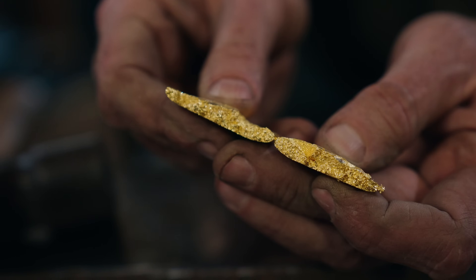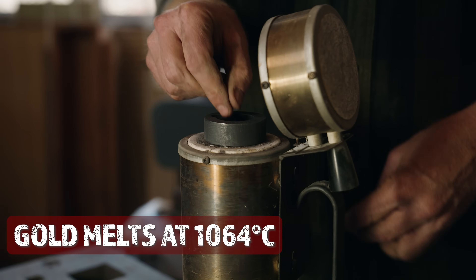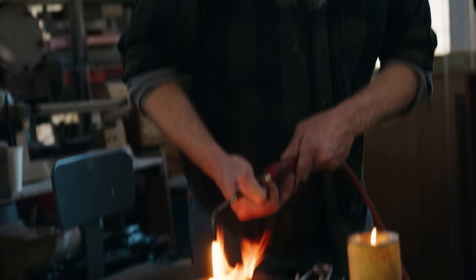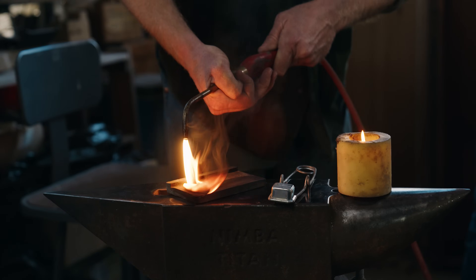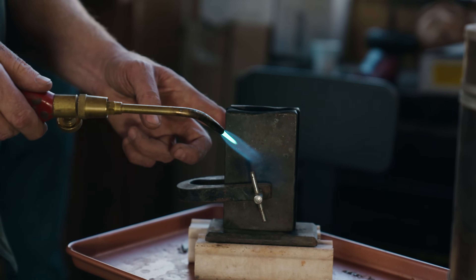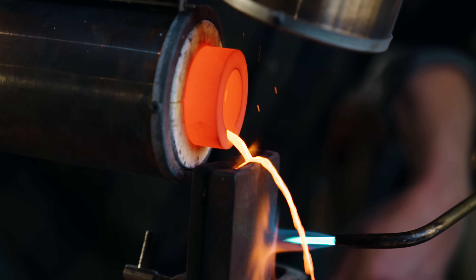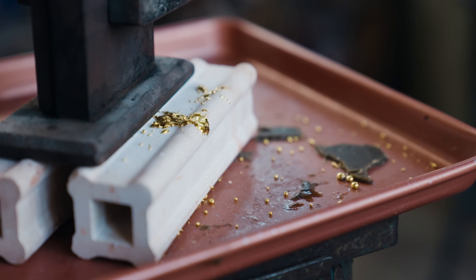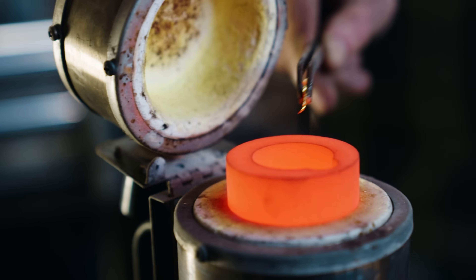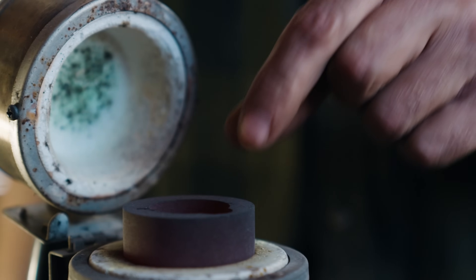Very, very crumbly — but boy, how cool is that! We're going to be pouring into a cast iron mold. We just want to make sure that we're not chilled. I'm going to be preheating this with a torch — not so much for the heat, but to get rid of all the moisture — and we've sooted it with a little bit of acetylene, which will prevent any of the gold from sticking. It takes a really steady hand to pour this material directly into that small hole from the crucible, which clearly I do not have. But thankfully I put this on a metal tray, so as the gold spills off the side it falls into the tray, cools very quickly, and we can put it back in the crucible and remelt.